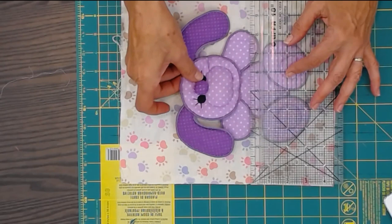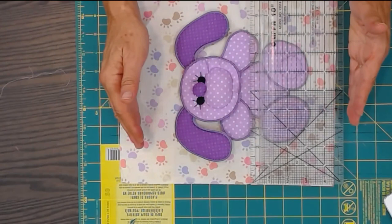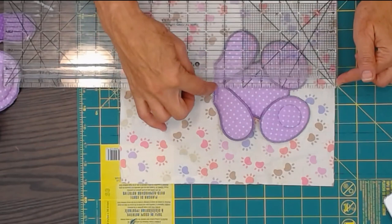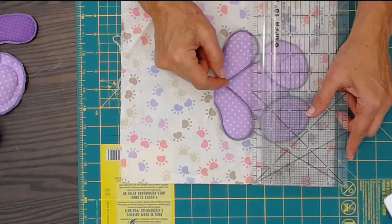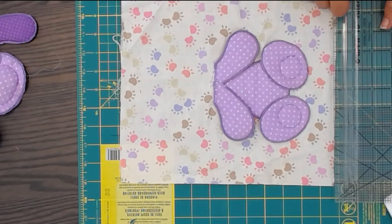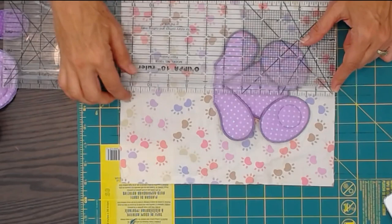Now we've got our body done and we want to place the head — that's a little more bulk — so we'll use our paper pattern for placing. We want to cut the edges of this block before we put the head on. Put six and a half inches in the middle of the neck — this is for a 10 inch finish block — then mark this edge and cut it. To cut the sides, put five and a quarter in the middle of his tummy and five and a quarter on the other side, cut the sides, make sure it's perpendicular, then from this edge measure 10 and a half and mark it.